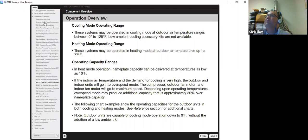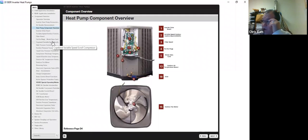When you remove the electrical panel on one of these units, you'll see three distinct boards. The bottom board is your variable speed control board — the brains of the system. The middle board is the filter board, designed to filter out dirty power that might affect the drive and compressor. The top board is the drive board, which actually powers your compressor.